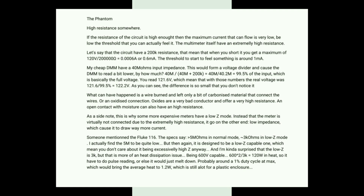I think the Phantom here has hit the nail on the head. What could have happened is a wire burned and left only a little bit of carbonized material connecting the wires. I think there's either a motor starter contactor inside the building controlling that exhaust fan, or the breaker has possibly failed — the terminals inside the breaker may have partially burned off, giving us carbon tracking that lets a little bit of voltage leak by but not enough to actually do any work.